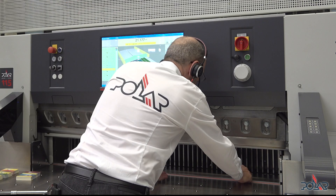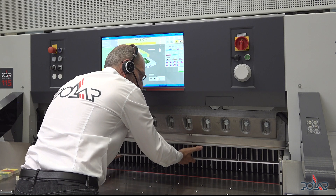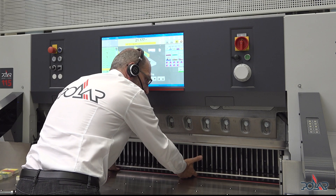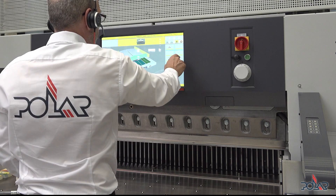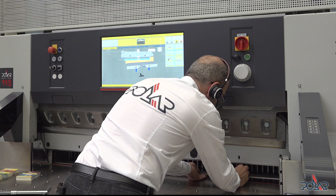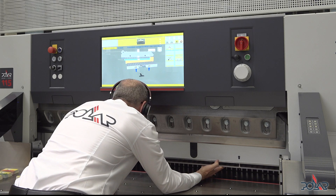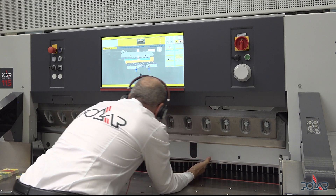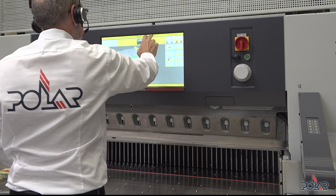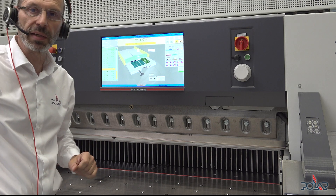There's a safer way. One thing is that doing this the full way manually is not ideal — it's a long way up, so my arms are free in the air and it becomes very heavy. I can use the knife change menu for this so that it is much more ergonomic. Because at this height, I can rest my arms and hands on the machine table and it's not so difficult to bring it into the machine. Finished. That's a very safe and quick way to get the false clamp plate out of the clamp bar.